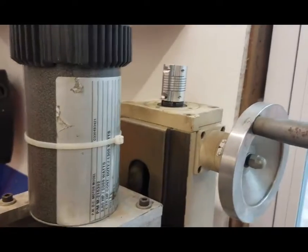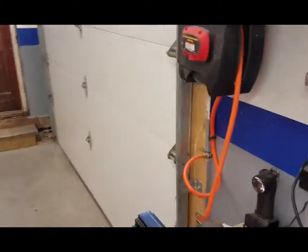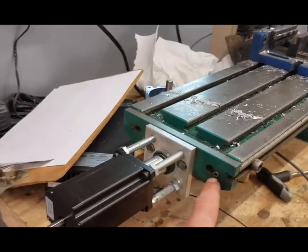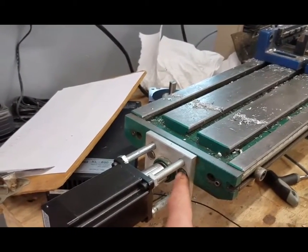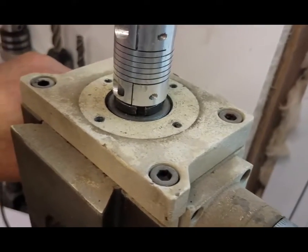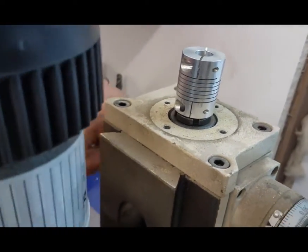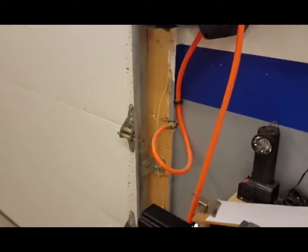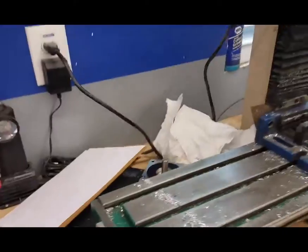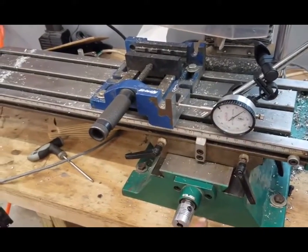I haven't done any more up on top other than I've made my drawings. On the z-axis I'm going to do virtually the same thing as I did on the x — make a plate that bolts on. Apparently I had to drill these holes into my machine at some point; I don't remember doing that, but on the z there are four holes up there already that hold the cap on. I'll remove the cap, use those four holes to bolt a plate on, and do some bolts for standoffs, tapping M5s into the top of them like I did here.